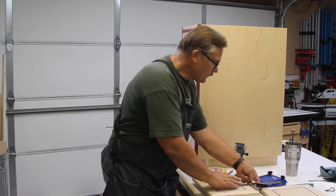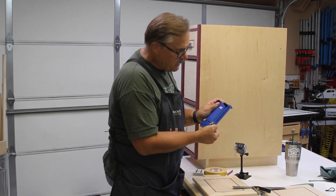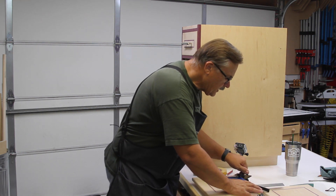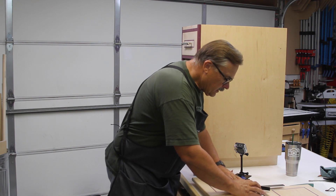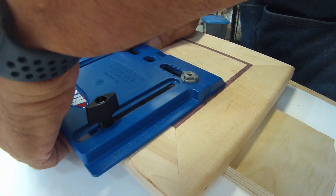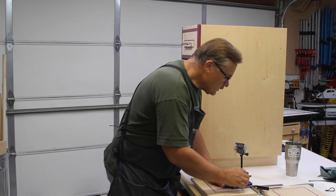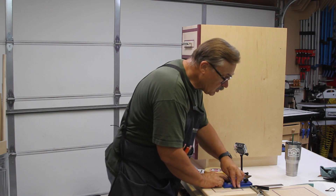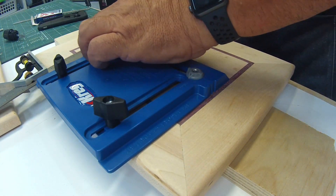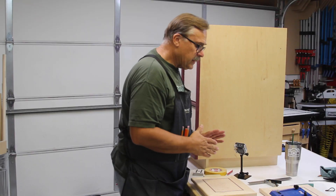Rather than make marks on my drawer I use this Kreg drawer drilling guide. It has a fence and a marking line for the center of your drawer pull. I'm going to put it up next to this combination square and make adjustments so that the mark is right at the end of my combination square — which is two inches below the top line of the purple heart — then I slide and lock the fence in so it's exactly two inches. So now my drawer pulls are going to be exactly two inches down from the bottom of that purple heart line, and I just don't want to make any marks on the drawer.